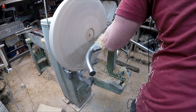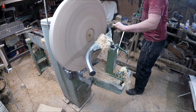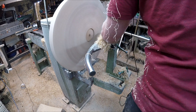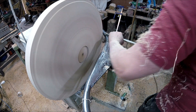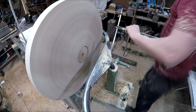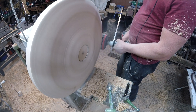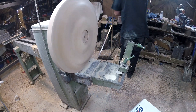So we're working on the back of the piece, spinning at 800 RPM. And a tough bit of sycamore this, to be honest — it's pretty slow going. All I was trying to do here is get rid of my mistake from the first time I drilled the holes, just cutting away the corner until those holes disappeared. And then just a bit of smoothing across the face. It took about a million years to sand. There was a bit of tear-out in the back, and I got frustrated with it yesterday and stopped sanding before I messed something up.